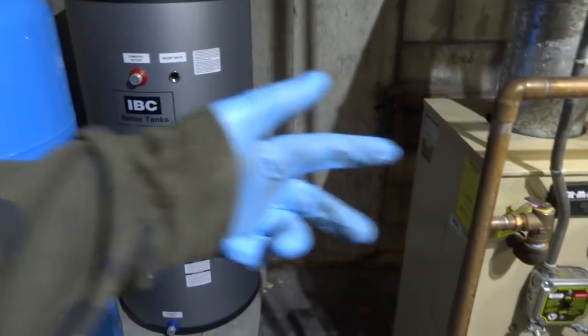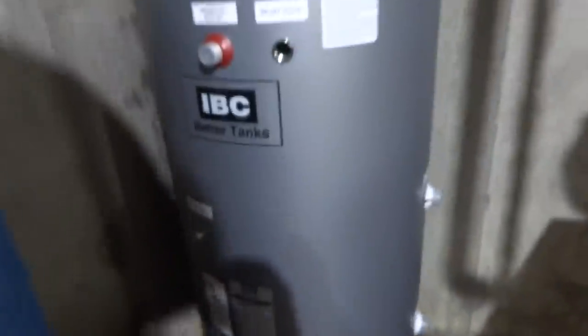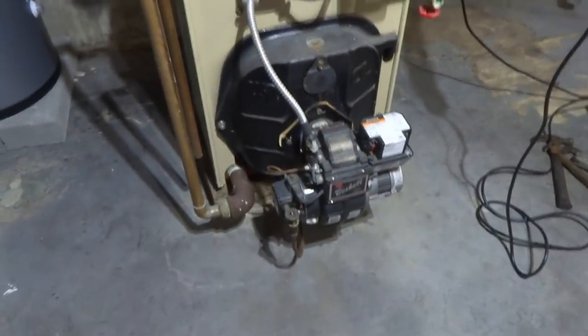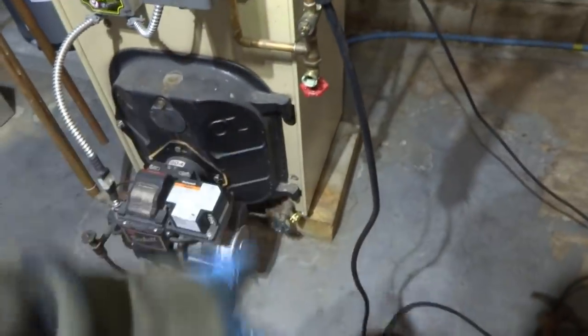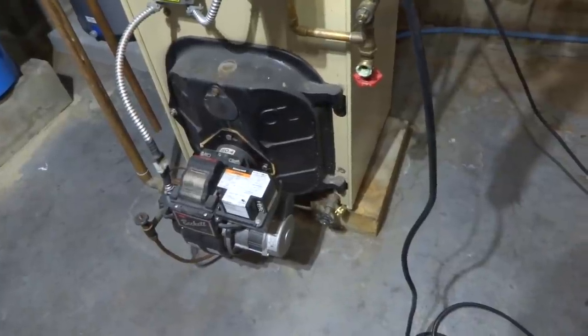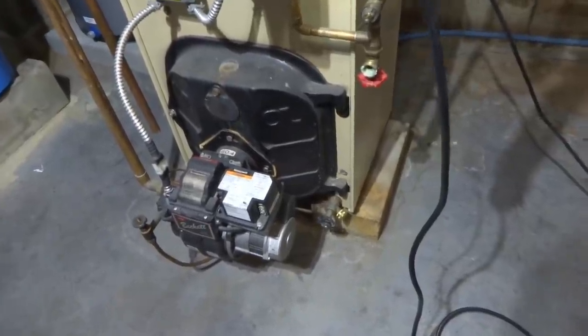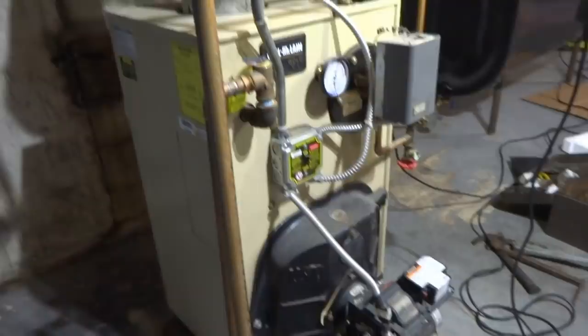Boiler water's going to come out the side, and then this hot and cold is going to come up and right up, so it'll be fine. The control's going to be over there, the relief valve. It's going to work out good. The return, I'm just going to come out and then maybe drop down underneath or something. Gotta make sure that door opens. I'll do something with it.